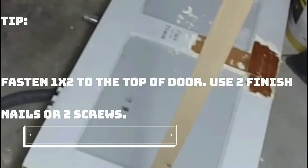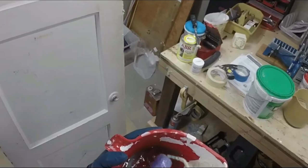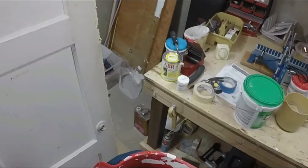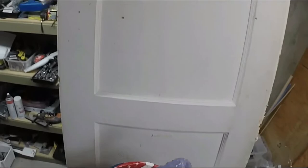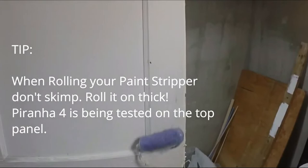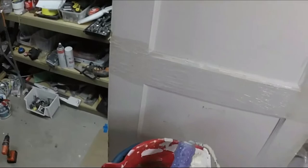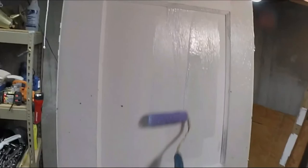I've got a 1x2 on this door and I'm going to prop it up against the wall — this lets me put paint stripper on both sides of the door at the same time. We're going to test out three strippers: the FiberLock Piranha 4, the Multi-Strip Advanced, and the American Building Restoration citrus formula. On the top third of the door I'm just rolling the Piranha on — it goes on really easy, faster than rolling paint.